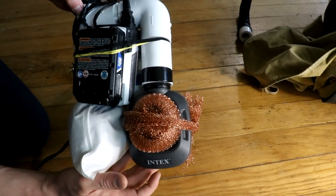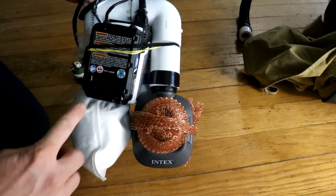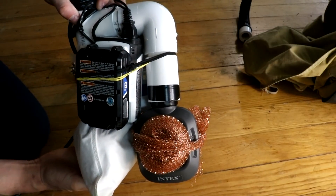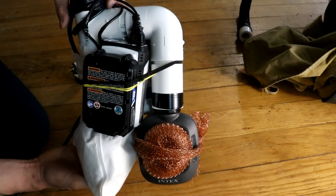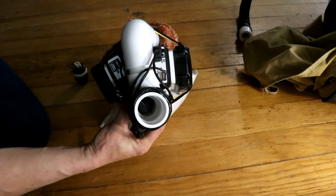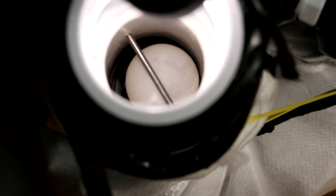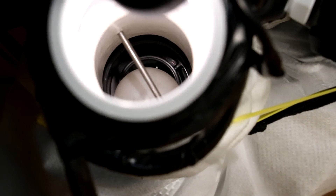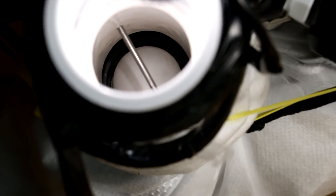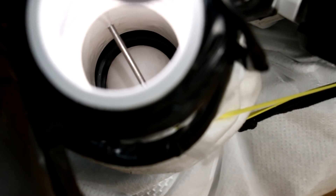Now the blowers, if one isn't running, have no way to stop air from the other blower going right through it, which would decrease efficiency and reduce the amount going to my hat. So I've made a couple of check valves. If you look down in there you can probably see it. If I turn the blower on, you see the ping pong ball floats up and lets the air through. Turn it off, it sits back down. I turn the other blower on and restrict this flow — you can see it sealed the other blower. I think that's pretty cool — very simple.